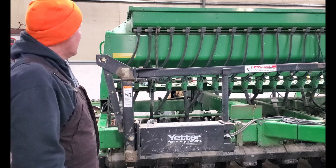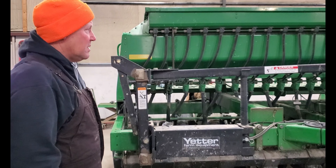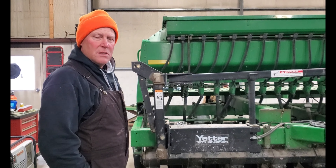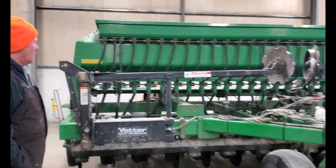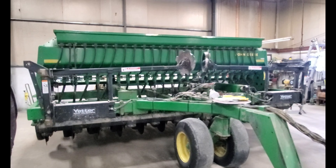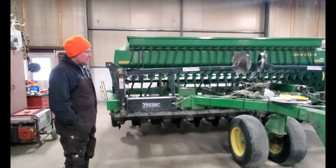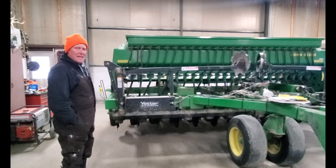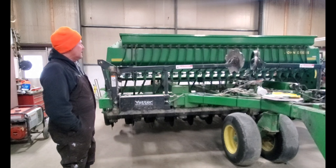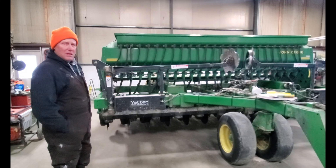This system here on the John Deere drill uses a single depth gauge wheel beside the disc opener. I keep saying drill because this is not a planter — what we plant the corn and the beans with is a totally different machine. We use this one for small grains such as wheat. It will also plant soybeans, but we don't use it as much anymore.